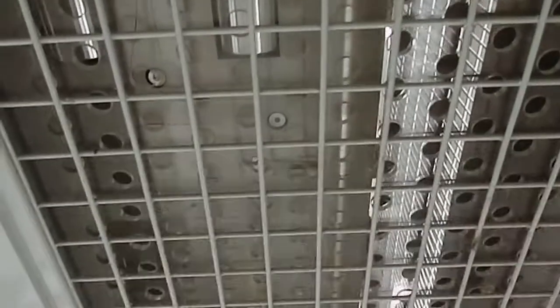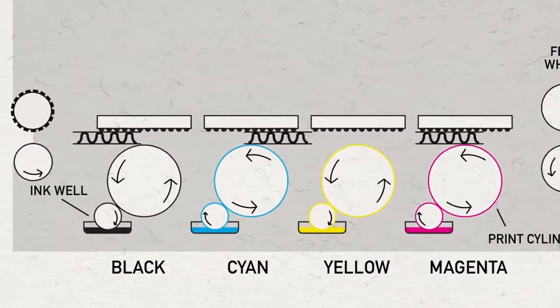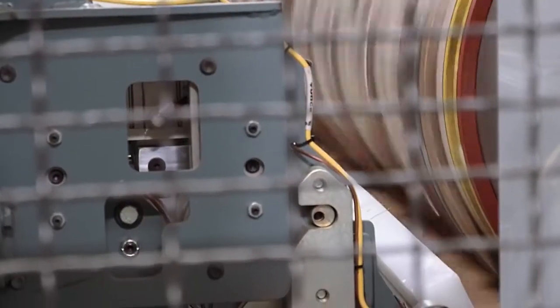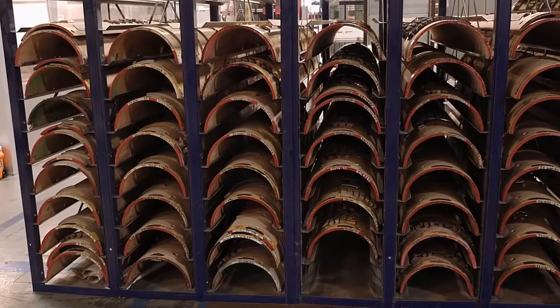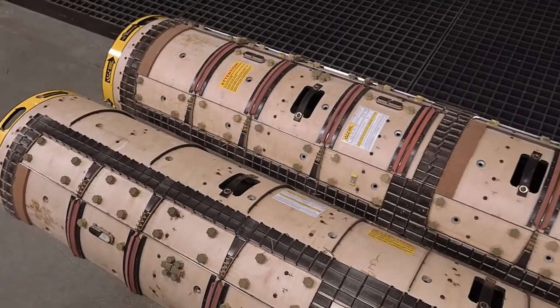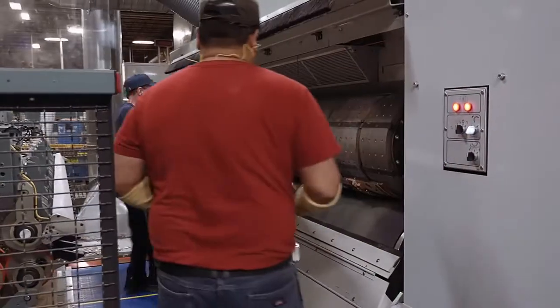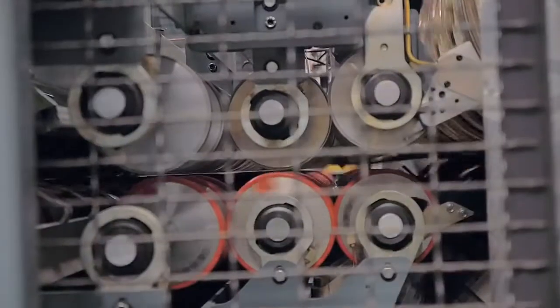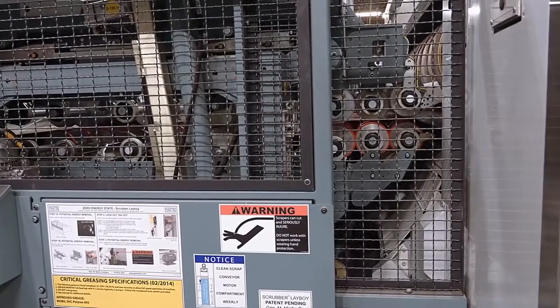A vacuum transfer system carries the sheet through the machine across multiple print sections. On a rotary die cutter machine, the designs and branding are printed on the bottom of the corrugated sheet stock. After the stock moves through the print section, it reaches the rotary die cutters. There are different cutters for every box type the factory produces; the cutters are built from two half cylinders with metal blades embedded, as well as foam rubber sections to eject the cutboard scrap pieces. Scrap is recaptured and recycled back to a paper mill. The next section, called the scrubber, removes any remaining loose cutouts and rough edges on the cut sheets.